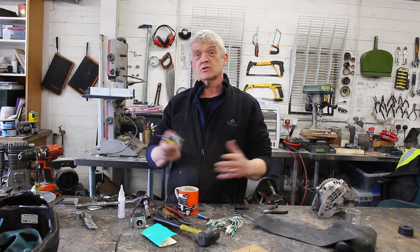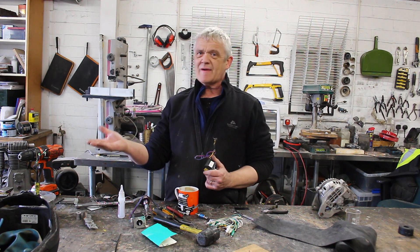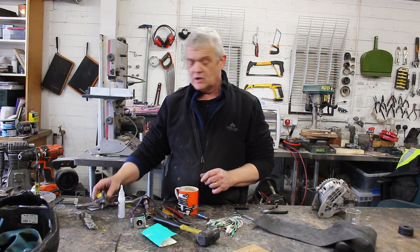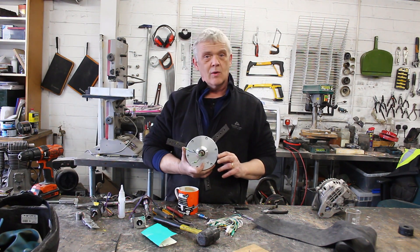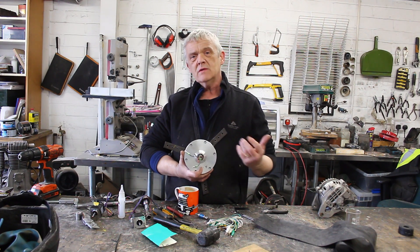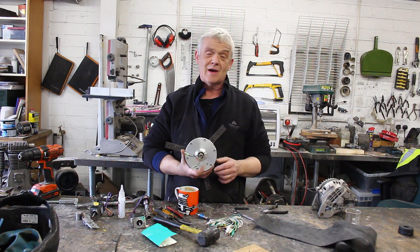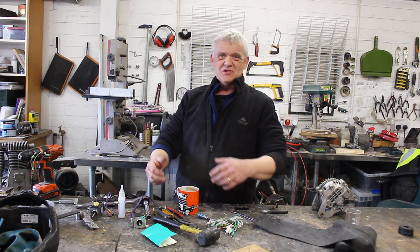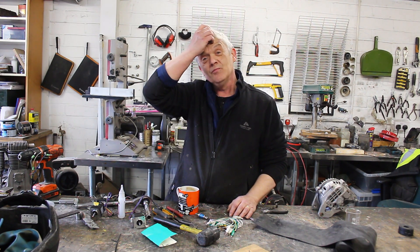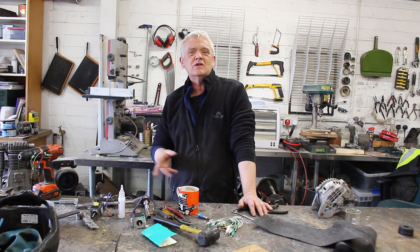We used a 100 to 1 gear ratio, so I'm turning that at about 10 RPM while the stepper is doing about 1000 RPM — it's going to put out some volts and amps. Now this other motor didn't work particularly well, and the reason is the gear ratio: it's about 12 to 1, so I'm only turning it at about 120 RPM when it's rated for 500 RPM. It's getting about a fifth of its rated output, which is about right — it gave about 12 watts whereas we got about 60 watts, so about a fifth.